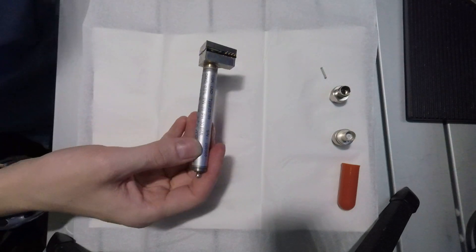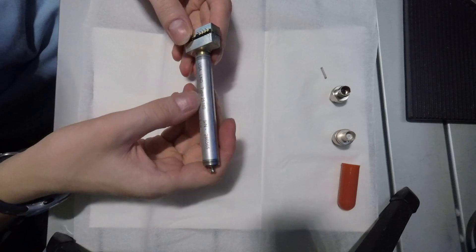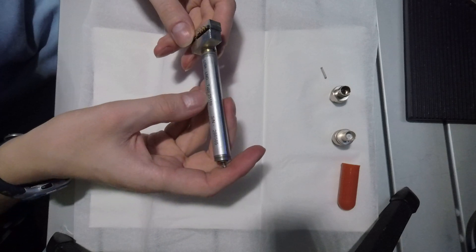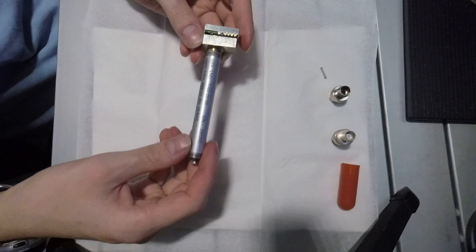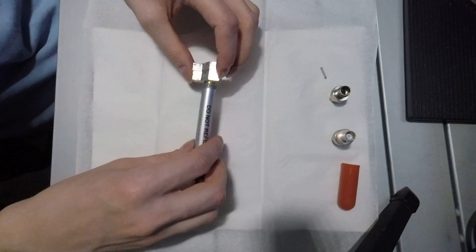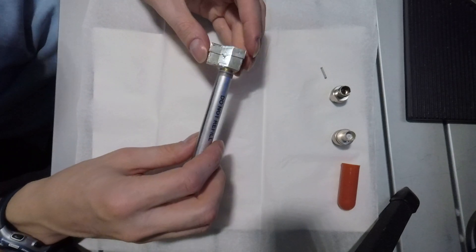What you see here is the detector tube. This is a 30-bar helium-3 tube, type LND 25169-2. It's screwed into a preamp box, which is shielded, and which interfaces on one of the main circuit boards of the GR-135 Plus.